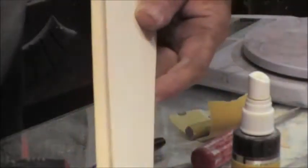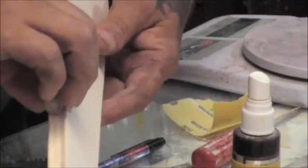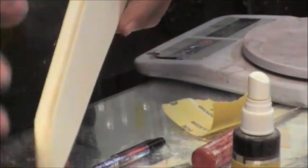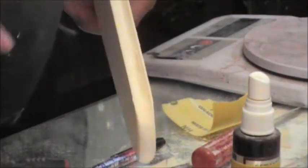And if you notice here, there's a chamfer, or a groove. I took a 3/8 dowel and sanded the groove. If you remember, I took the 1/4 inch router and I routed the 3/8 fill piece, the center piece. So we had a 1/4 inch in there. Then after I got the sheeting on the top and the bottom, I took the 3/8 and finished it off and smoothed it out. So that fits inside like that, and they rotate right on the leading edge so that there is 0 gap.